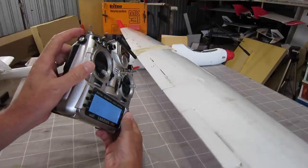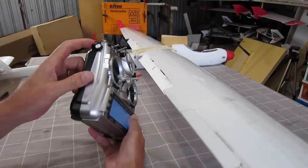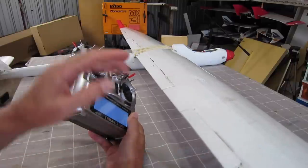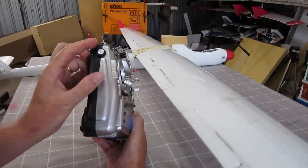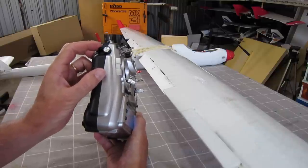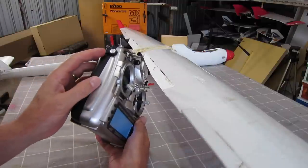The way I like to set it up is to have it on the slider. What I've actually done is have the flaps going down to the halfway mark and then crow or ailerons going up from halfway down to all the way down. The reason I do that is it means I don't have to offset the ailerons. So my slider goes from plus 100 down to zero with no movement of the ailerons but I still have full aileron movement, and then from zero to minus 100 a little bit of reflex kicks into the ailerons.